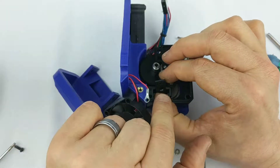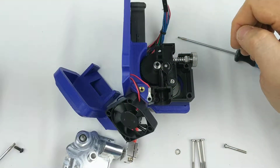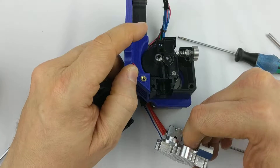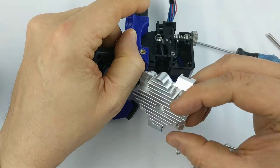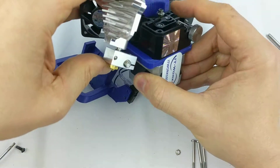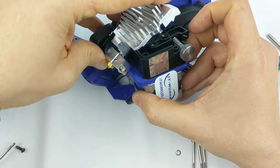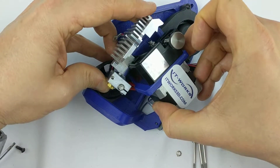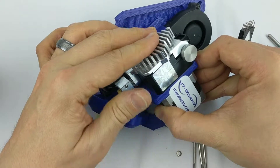We do sell these filament guides if yours wears out. Just make note of whether it says 2.85R, 2.85L, 1.75R, or 1.75L, because there are four different models — mirror and non-mirror. The trick I'd suggest is to make sure your wires are clear, tilt the tool head back so that gravity and friction hold the filament guide in place, then use the top here to push it against your filament guide to hold it. Then tilt it down until it lines up and push it to snap it in place — usually it'll snap nice and straight.